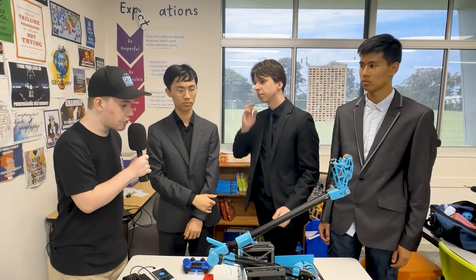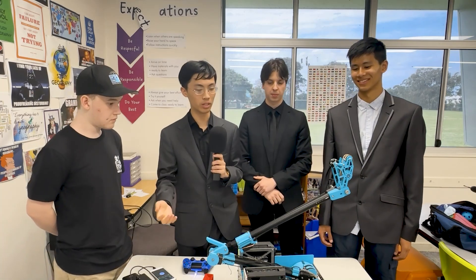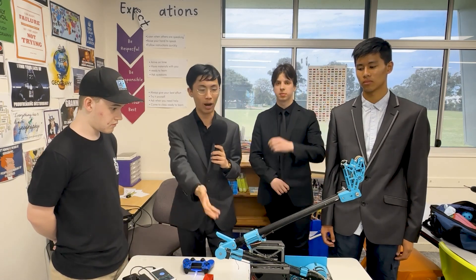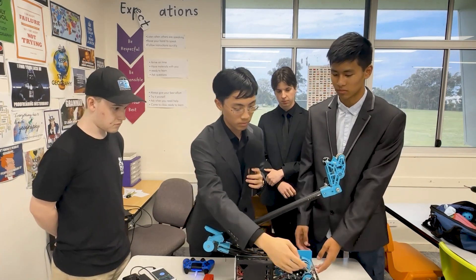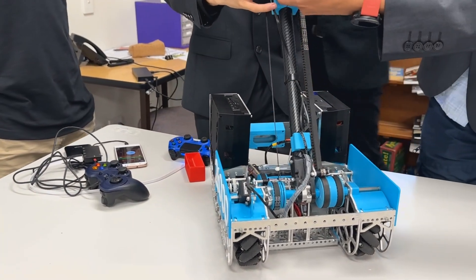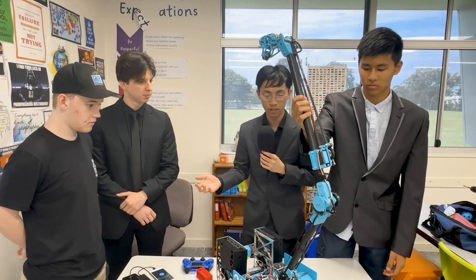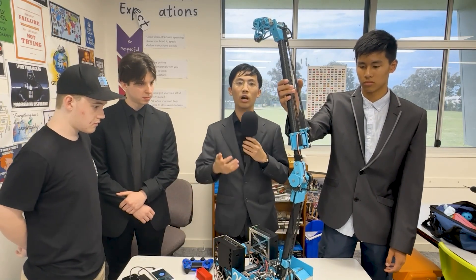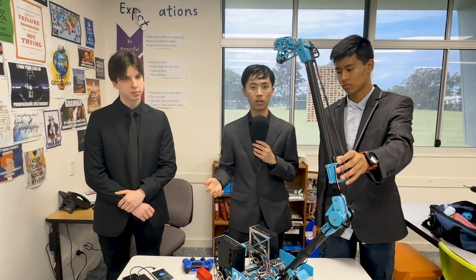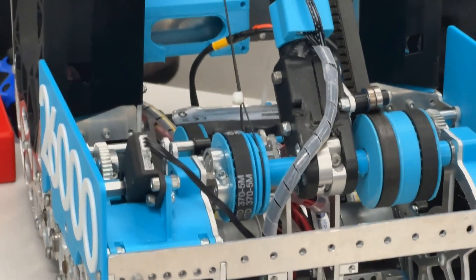How did you ensure that you were going to stay in that horizontal extension limit? Yeah, I'll pass it to software. So we had to use quite a few different control system methods to make sure that our arm would stay in the right place. As you can see here, we've got an analog encoder here and another analog encoder hidden away over here. This allows us to have complete control over our two joints no matter where they currently are in game. If we somehow manage to lose power during a match or accidentally run into another robot, those absolute analog encoders will always tell us the position and so we can run to it whenever we want.